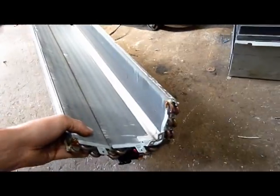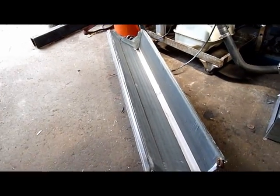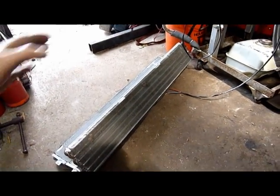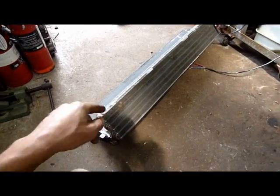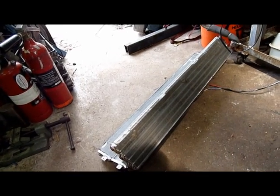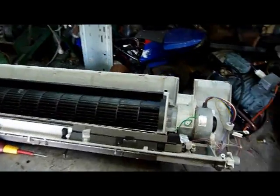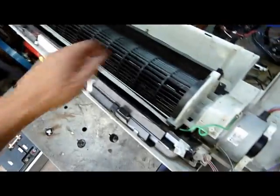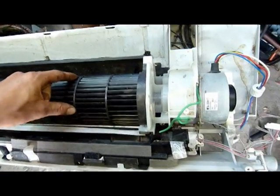So you can't really implode these — they're very tough. Even making them pop you'd need hundreds of pounds per square inch, a thousand PSI or more. You won't see any videos like that unless I get a big enough pressure chamber, crank the ambient pressure up to something like 150 PSI and then pull absolute vacuum on that — then you might have enough ambient pressure to crush the tubes. Remember, when you pull a vacuum on something, the only thing that squashes it is the atmospheric pressure surrounding it. Vacuum doesn't crush something from the inside; you just change the pressure differential so you've got positive pressure on the outside. Barrel fan — glass filled nylon, pretty hard stuff.